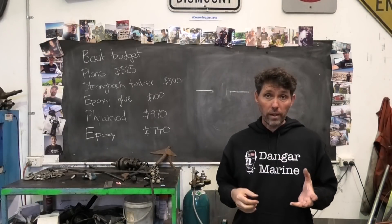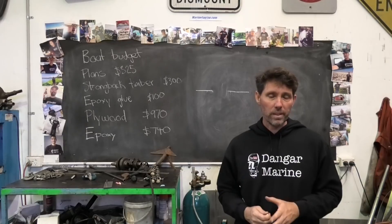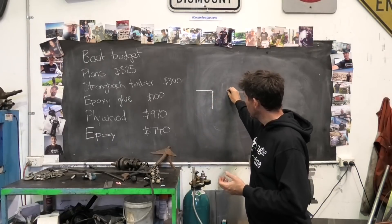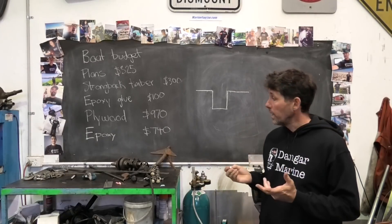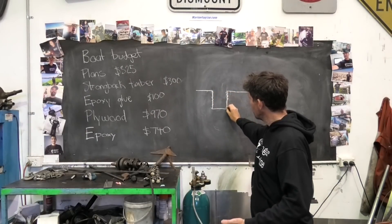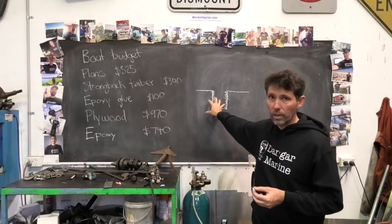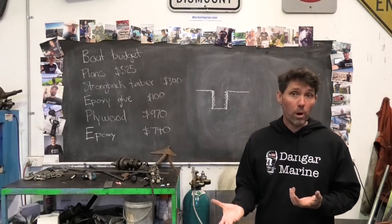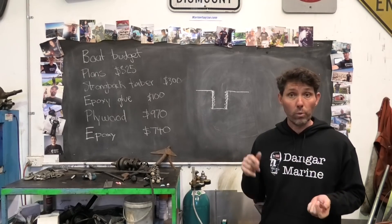To solve all these problems, you get a thing called a thread repair kit. There are plenty of different brands — like Helicoil, TimeSert, Recoil — and everyone has their favourite. The idea is that you drill away the damaged thread, then tap a new thread in the hole, and then you insert a repair kit insert that restores the thread back to its original diameter. This then allows you to put the original bolt back in, or a new one of the same diameter. So let's head over and I'll show you one of these kits and put one into an outboard.